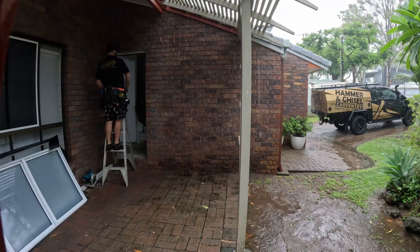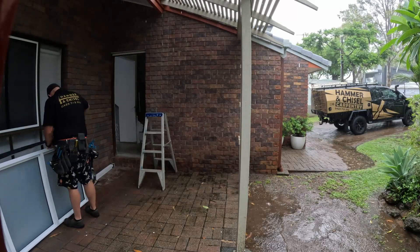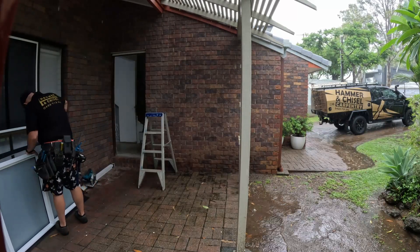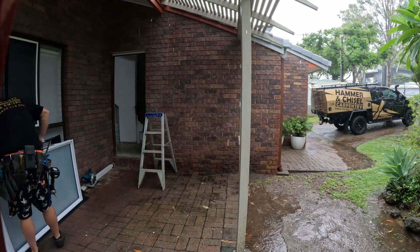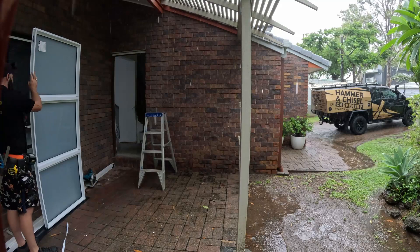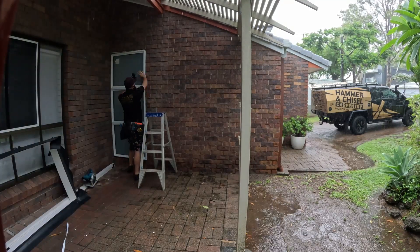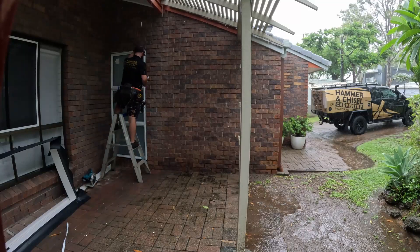On the right-hand side of this window I've had to take the little fin off the aluminium frame. This is because the brickwork is going to be impeding on it — the fin sticks out further than the actual window frame. By pulling that off, when we insert the window into the opening I can insert one side in and the fin won't be in the way on the other side when I go past the bricks.